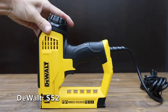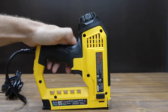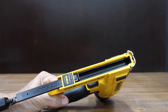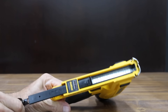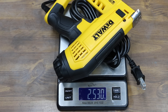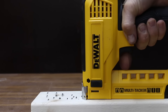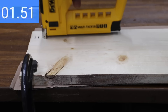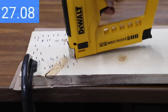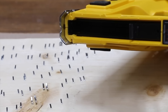At a price of $52 is this DeWalt electric stapler with depth control. It uses heavy-duty narrow flat-crown cable staples, 18-gauge brad nails, and 18-gauge headless pins. A high-low power switch allows the tool to drive into hard and soft materials, and it claims to work in oak as well as pine. The DeWalt weighs 2.53 pounds and measures 99 decibels. It takes just over 2 pounds to activate at 0.05 seconds. Like all electric and battery tools, the DeWalt must be lifted and the trigger released before the next staple. It completed 80 staples in 39 seconds — second fastest yet. No issues with jamming.